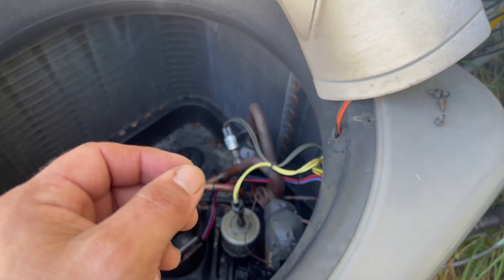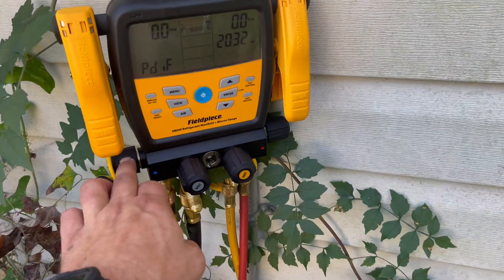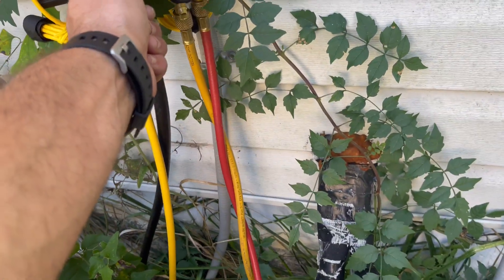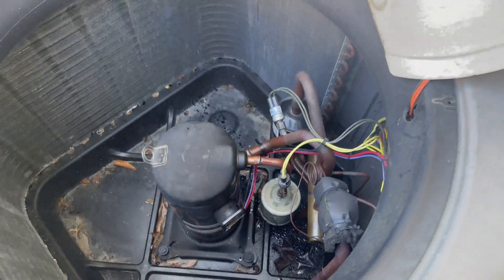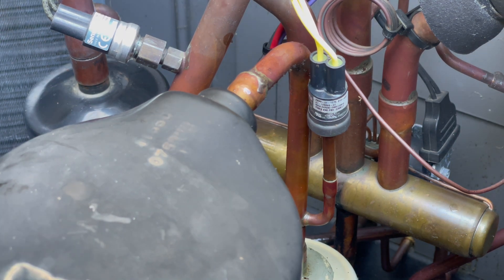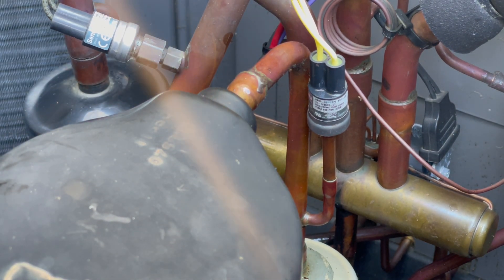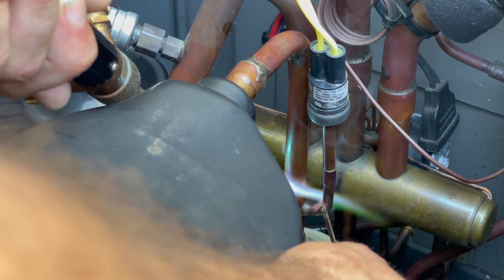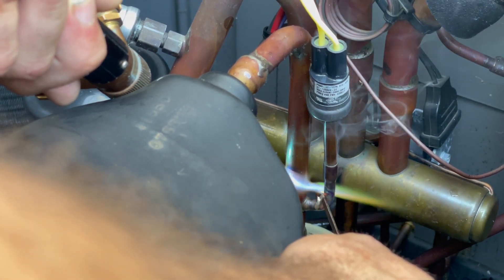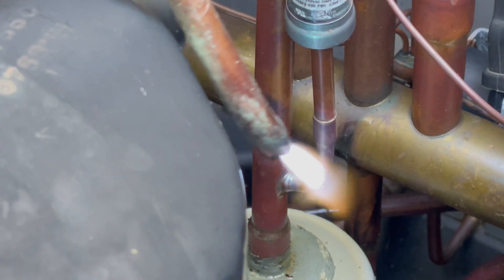It should be extremely quick to blow through this line. Just leave your gauges open so you can make sure this thing doesn't build up any pressure as you're soldering. We're trying to do this as quick as possible and with as little heat as possible — watch for your wires and everything else because you've got a lot of them going on in here. Just want to glob up some solder that way you can play with it once you warm it up a little. It's a funny angle to be at.